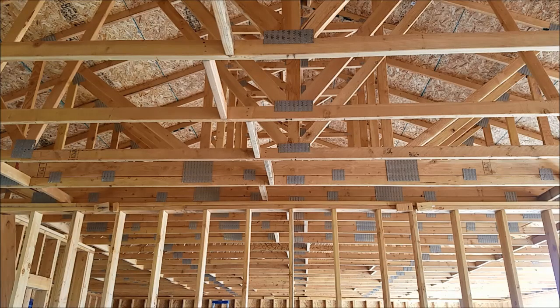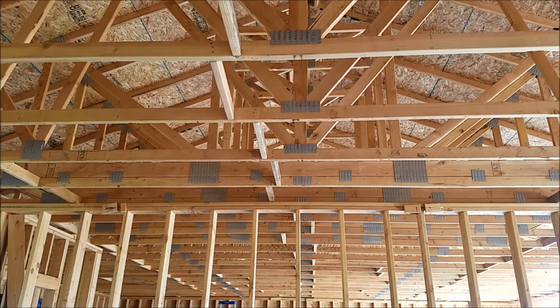I don't know if that's really how that's supposed to go, but I can't find a good answer on how to do that. When you read on the internet about how to brace the bottom chord for alternating trusses, the best answer you get is talk to a building engineer. And since there isn't one, we're going to brace it the best we can and hope there's no issues.